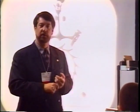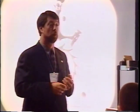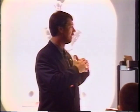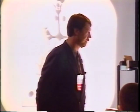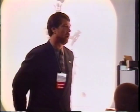One of the things that people miss a lot on some of the older 17 jewel watches is that the lower center pivot was not jeweled. There's a lot of wear there, and the high torque, or high contact with the center wheel pinion from the barrel, pushes that center wheel arbor over. If you've got a worn hole, that's a big loss of power that you can experience. So before you even look at the escapement, you've got to make sure that these certain things are correct, such as backlash in the train and that kind of stuff.